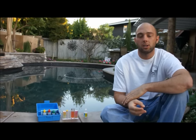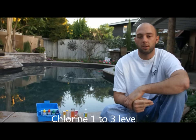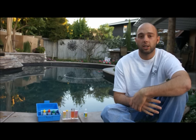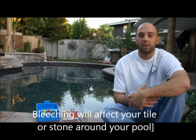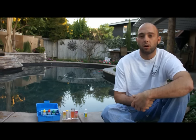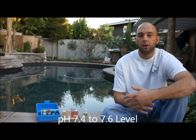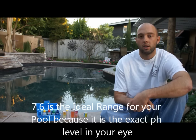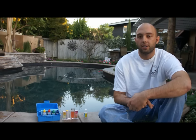So today we've tested the chlorine, the pH, the alkalinity, and we've also performed the acid demand test. We've learned that with the chlorine, we need to keep it between one and three parts per million. If you drop below one part per million, we'll typically have problems with algae, and we'll also be susceptible to viral and bacterial infections. If we have too much chlorine — above three parts per million — we'll typically have problems with bleaching of the eyes and the skin, and it'll be very irritating. With the pH, we typically want to keep it between 7.4 and 7.6. If the pH drops below 7.4, the pool will be very corrosive — it'll corrode your plaster and your heat exchanger, and be very irritable to your eyes and skin. When the pH rises above 7.6, it'll be scale forming, meaning you'll get calcium buildup around your tile lines, also in your heat exchanger and plumbing, and you'll also have very irritated skin and eyes.